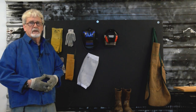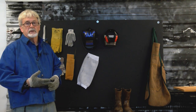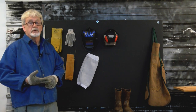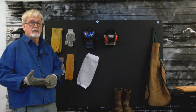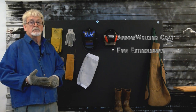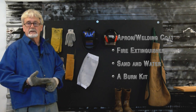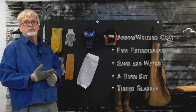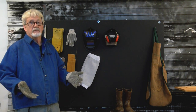Most of the videos I've seen on YouTube do not talk about safety, whether you're electric or gas welding. This is very dangerous equipment and the temperatures reach 2,000 degrees in some cases. So you have to be properly dressed, and you have to have fire extinguishers, sand, and water. I keep a burn kit handy — it's like an ice pack that you crush. You can get all that at your welding supplier, and it's good to have. Hopefully you won't need it, but it's always nice to have it there.